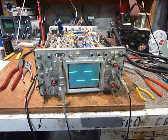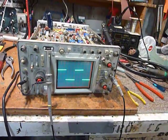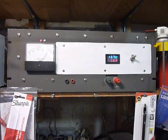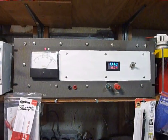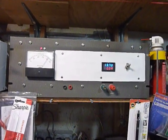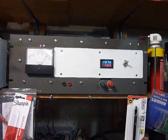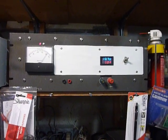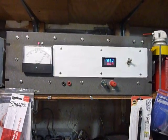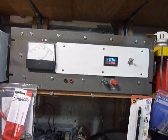Hi, this is Bob. This is Wednesday, 10/16/2019. I was working today on a power supply right up here. I first got this power supply in 1972 — it's a 1950s vintage power supply designed for rack mounting. It had a selenium rectifier assembly in it. When I got it, I took that out. There was also a filter choke in there that weighed over 12 pounds, and I took that out and reduced the weight considerably.